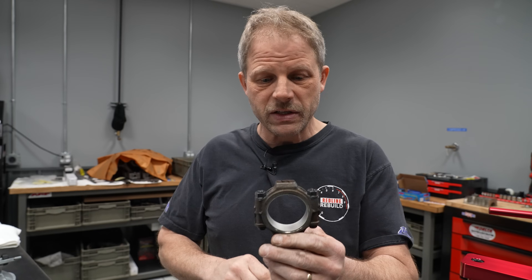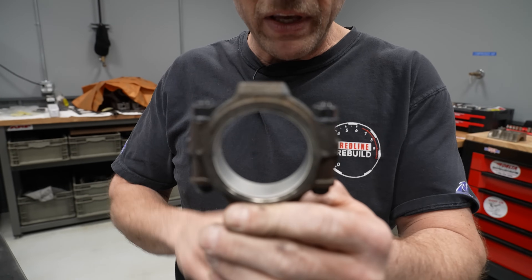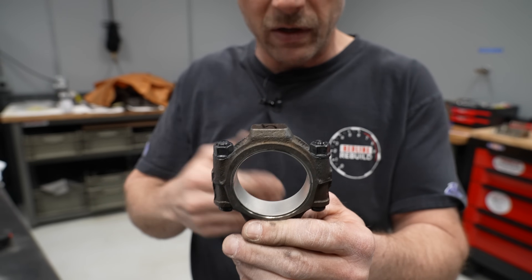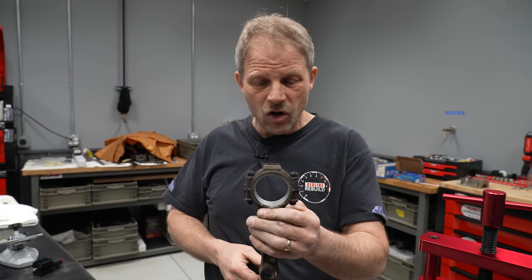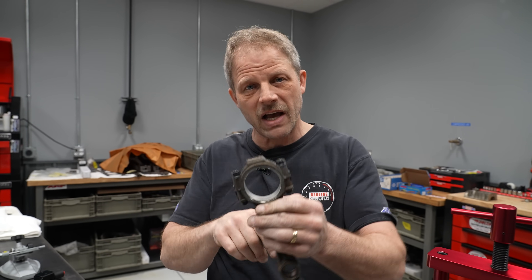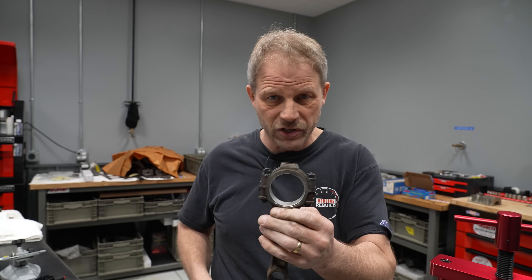What I need to do is verify this number and give the machinist a number that allows for oil clearance. Oil clearance is simply this: you have to have room for oil because the bearing does what the bearing does, but oil is what lubricates everything. If you don't have oil in between there, obviously it's not going to work. If the bore diameter and the shaft diameter are exactly the same size, it's not going to turn — there's not enough clearance for oil to be present and allow rotation.